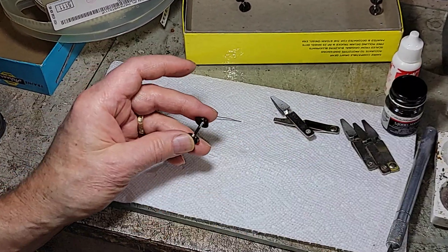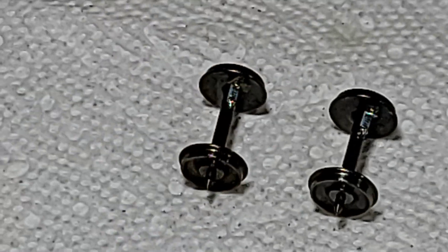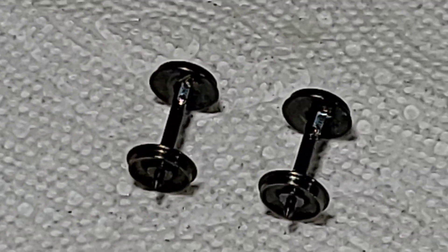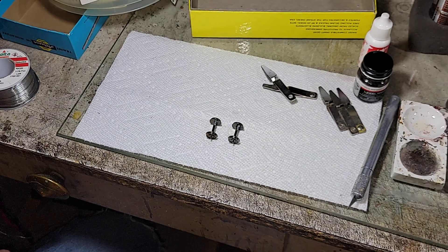And that's all there is to it. You can make your own resistance wheel sets very quickly and very cheaply. You don't have to use paste or silver epoxy, which is very expensive and can dry out very quickly. This method makes it very efficient and very quick. Well, there you have it — a great tutorial by Doug Geiger showing us how to make resistor wheel sets. If you have a signaling system and need resistors for your freight cars to be detected by your signal system and block occupancy detectors, it's a great way to add a cheap resistor to your axles. Thanks to Doug Geiger for showing us this. We'll catch you next time — keep your trains rolling. Rio Grande Fan out.